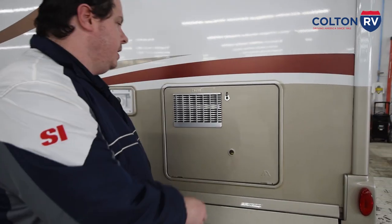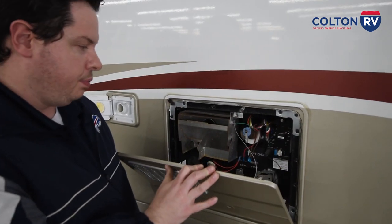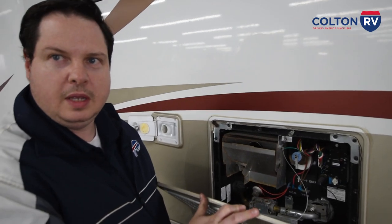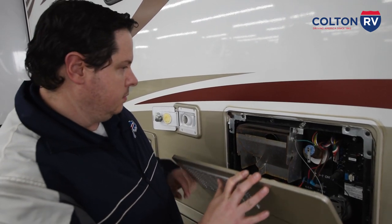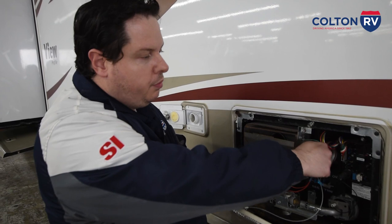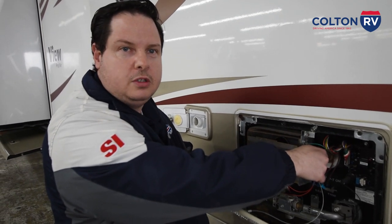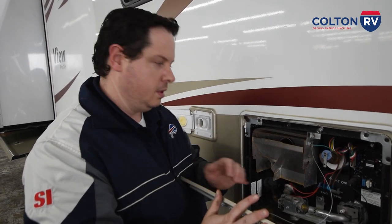This is your Atwood water heater. Not a whole lot to play with in here, but when you do winterize it, you want to make sure this is empty — that there's no water in it. You want to take this plug out. A good idea so you don't lose this plug in the winter is to just leave it in this compartment so you find it in the springtime. Before you pull that plug, a very important point: you do want to let the pressure out of it. Make sure it's cooled off and let all the pressure out so the water doesn't come spraying out as you're loosening the cap.